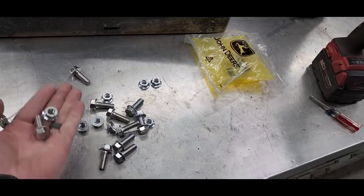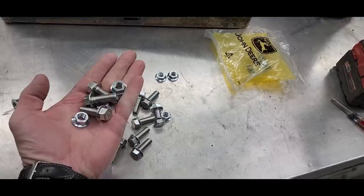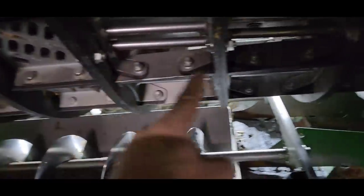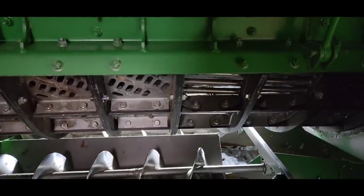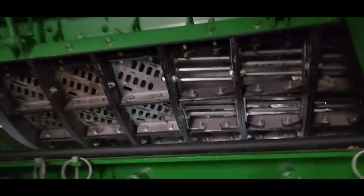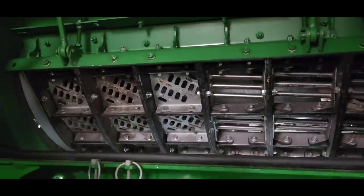That's it, yep. So, all right, we can bolt those concaves back together and get everything tightened up, all them bolts. I think I only need three. Okay, these bolts are all tight. I put bolts through the sides up here, another row down there. I think I can do one more on the other side, and we should be good to go on our concaves. We should do a concave leveling procedure where you close it and rotate it and adjust these bolts, the nuts kind of up on top there, to make sure that it's level and at the right spacing.